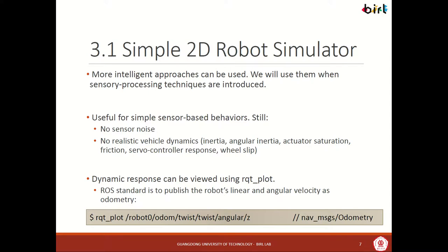Actuator saturation. Saturation here means, let's say that you want the, just like this, Eli, stand up. Now I want you to put your hand back here. Don't move. Yeah, just touch my hand. Touch my hand back here, more, higher, higher. That's saturation right here. You can't move more because you reach your limit. Motors have limits. When they reach the limit, they saturate. Yeah? Everything has a limit. Yeah, you cannot go further back than this.